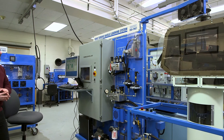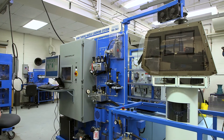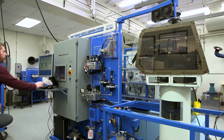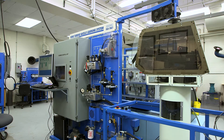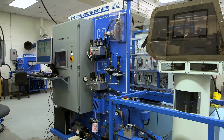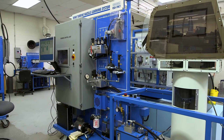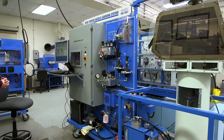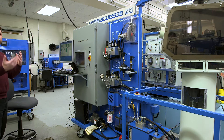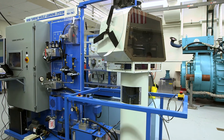Right now under the fault, it's saying the wind speed is less than 4 meters per second and it's waiting for the average to come up. We put it in run mode and the hydraulic pump kicks on — the system is pressurizing and you can see our gauge telling us our pressure. The whole nacelle is turning to face into the wind, and in order to do that, it has a brake.